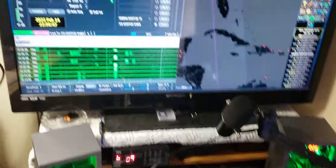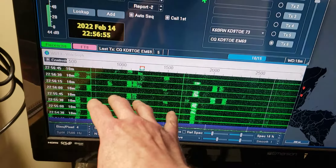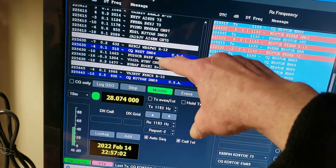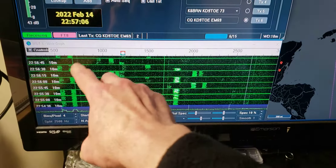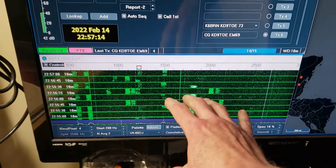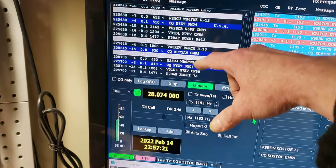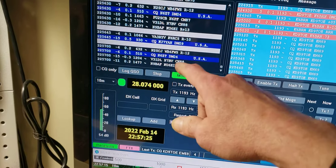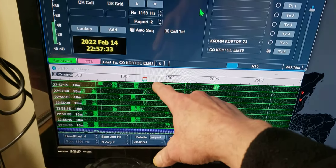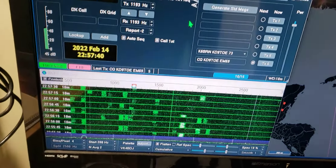That's a little hint for running your FT8. When this screen has a little bit of population - signals coming in - that's when I sit and hunt. It tells me 'want to call, want to call,' and I just try to click on them. But if your screen is kind of empty with only one or two guys in there, that's when I call CQ, because you'll get guys that are sitting there listening but not calling CQ. I sit on a frequency where I know my radio works good, get a lower SWR, and call CQ from there.